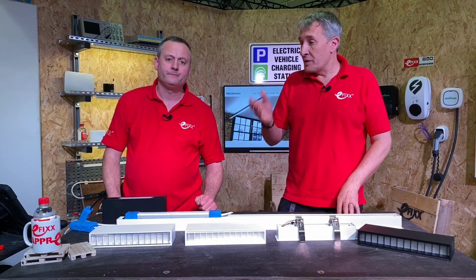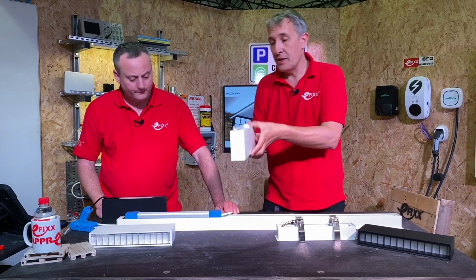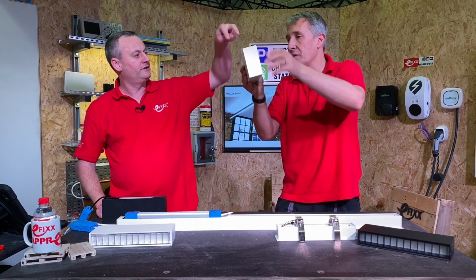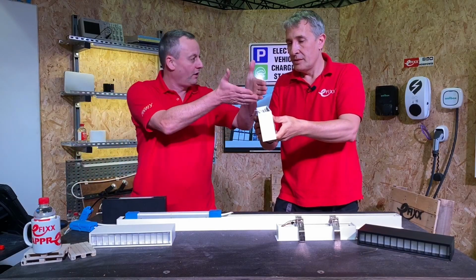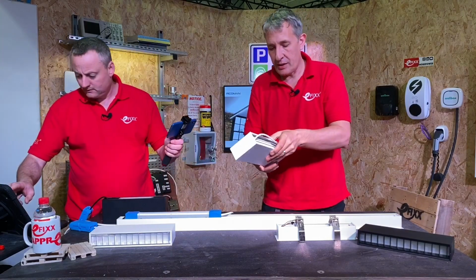So you can, yes. Obviously, I like the wire hanging option, but you can mount that to the surface of the ceiling. So this would go straight flat up to the ceiling with a mounting clip in there. So we insert a clip into here, which we screw to the ceiling, and we clip the light fitting in. Yeah, okay. So let's do it, Gary. Bring the camera in and have a closer look at this first profile.